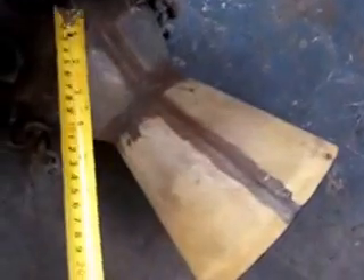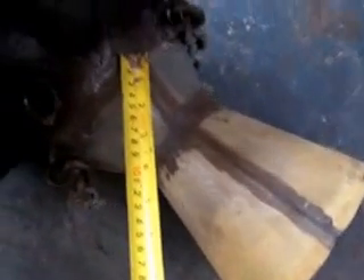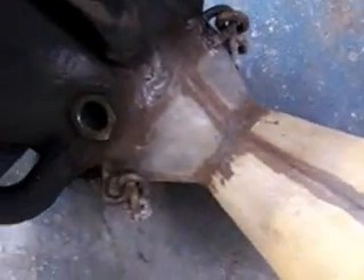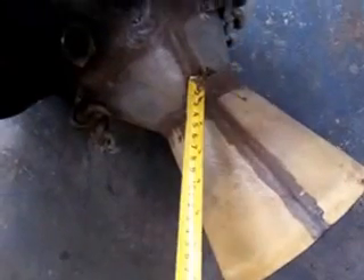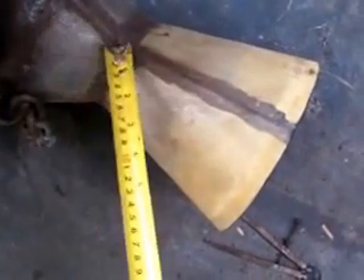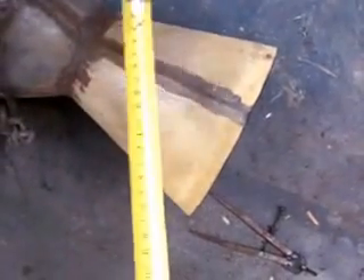The nozzles sit just above that, about an inch above where it starts to become a cone, and go down to the reduction zone. What I'm going to do is cut it straight across there. I'm going to use this bottom cone, turn it upside down and weld it to the top. And this cone here I'm going to get rid of, and I'm going to put a straight section of pipe at 2½-inch diameter in there and readjust the grate to suit.